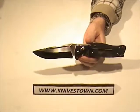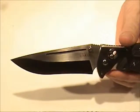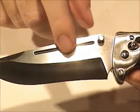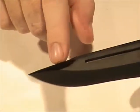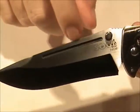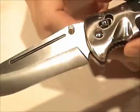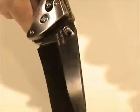That's not a trick of the light you're seeing on the blade — that is actually a two-tone blade. The blade has titanium nitride coating on it, but the flat part, the unbeveled part of the blade, has been left as polished steel, and the titanium nitride has been applied to the spine, to the swedge, to the hollow grind, and also into the fuller. It gives it a distinctive look. I don't know of any other knife that does that.